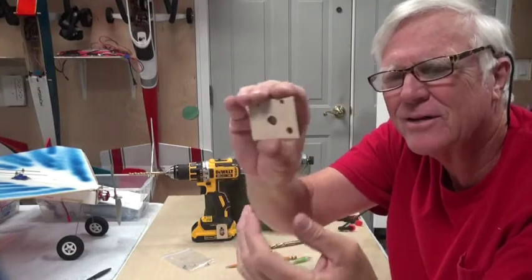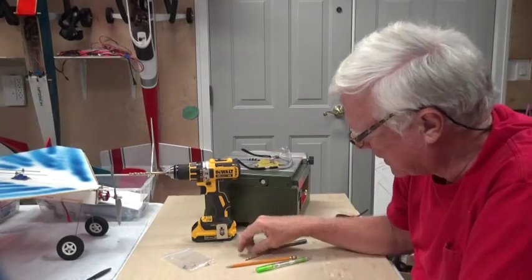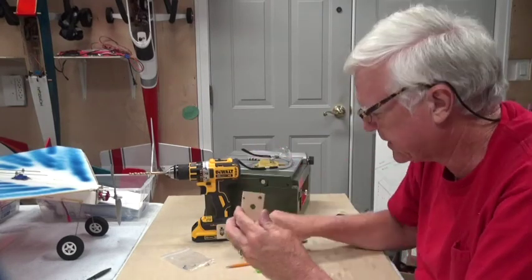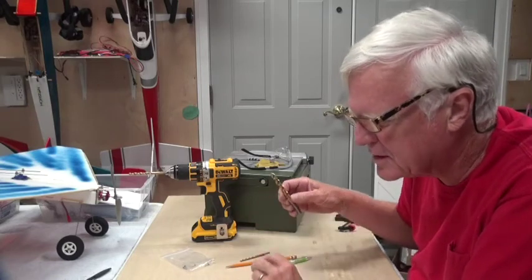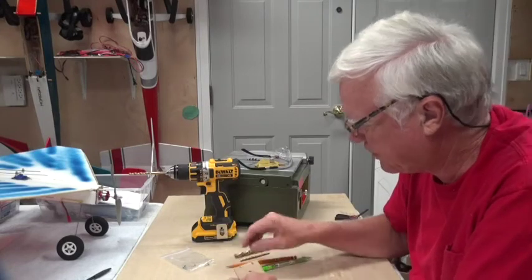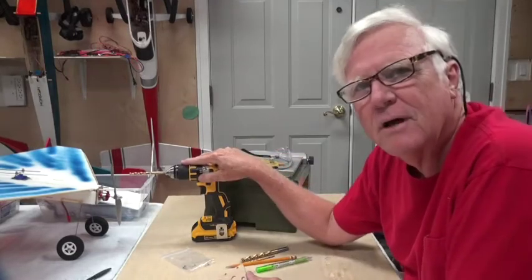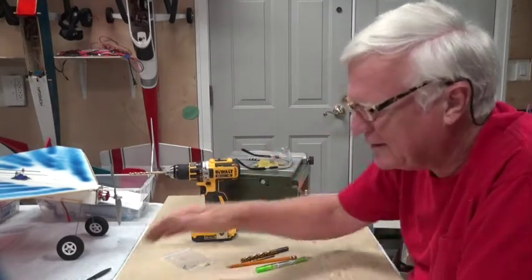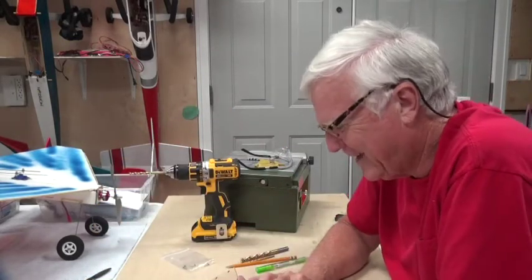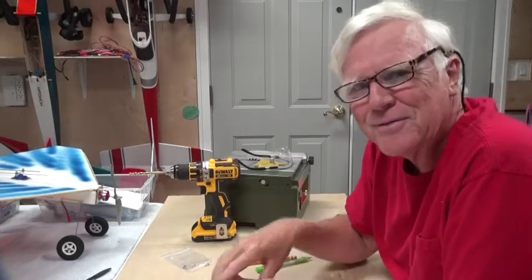It's big enough. The holes were: 11/64 for the 2 holes on top, 13/32 for the center hole, and 9/32 for the small hole at the bottom. Having a good drill, a good saw, and a nice set of drill bits, you can do this. If you don't have all this, spend the dollar it takes to buy one of these. I'm doing it just for fun.